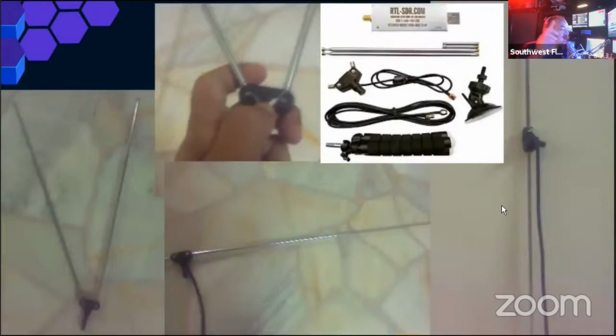That's basically the dipole. Now, a lot of you guys have this sitting around. This is an interesting thing. You could take this little kit that comes with your SDR Sharp, the one I told you 3 weeks ago not to buy. If you did buy this kit and it's sitting around your house somewhere, the little rabbit ears, take the box apart and see which side is connected to the positive leg of the antenna connector. And then mark that side and put it back together. Then turn it around like the right picture, and that becomes your dipole. Now, just push the antenna in or out, top and bottom, to length for the frequency that you want to talk on. And now you have a tunable dipole antenna.